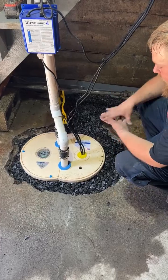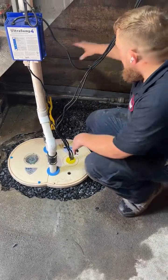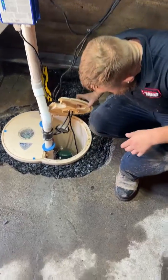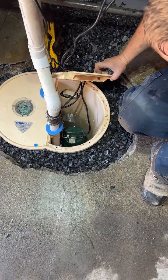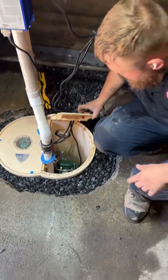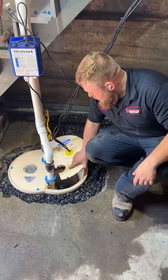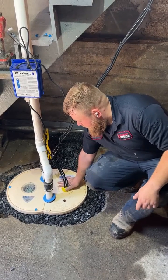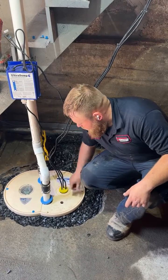This pit is also equipped with a radon neutral drain — the ball system that floats so water goes under and covers the hole. The whole perimeter is tied into the pit via this feed line, where it pours directly into the pit. During high flows of water from outside, it'll percolate through the holes from beneath.